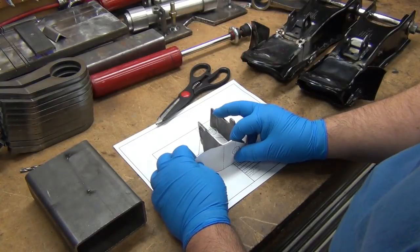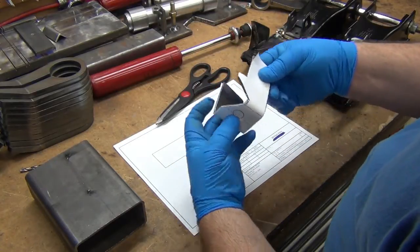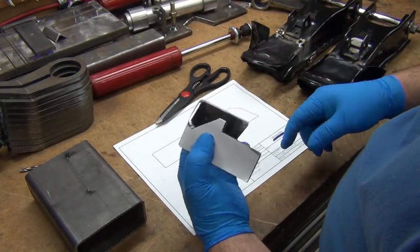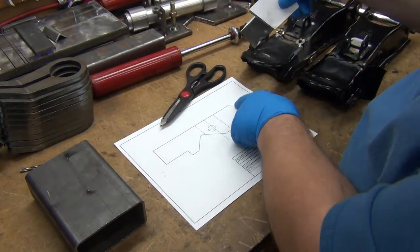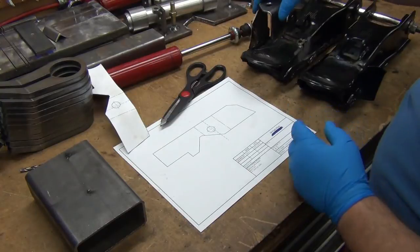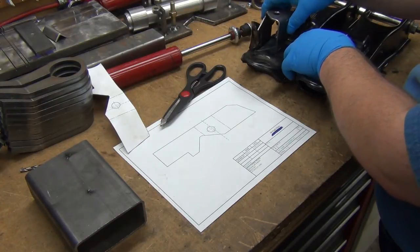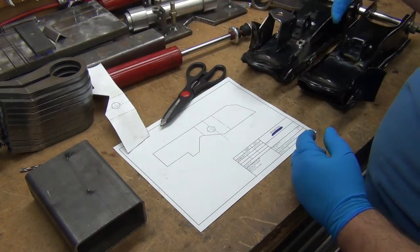As you can see, it's pretty darn close. I got the lengths about right — this is going to change slightly. I added a clearance chamfer back here just to make sure it clears the weld when it mounts up. I could have made this thing a little bit shorter, but it's 120-wall rectangular tubing and I just want to keep it as beefy as possible.